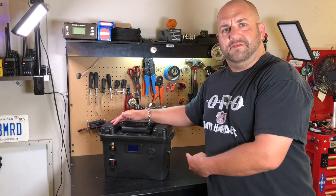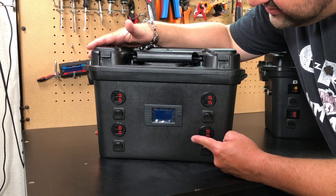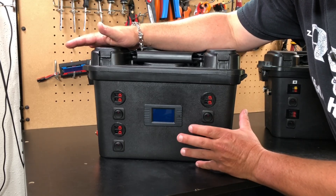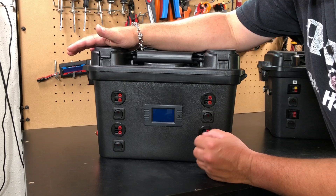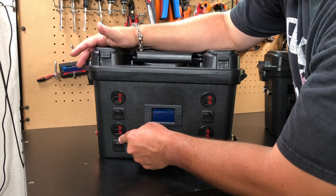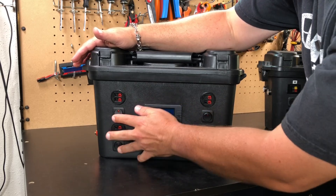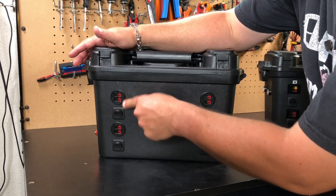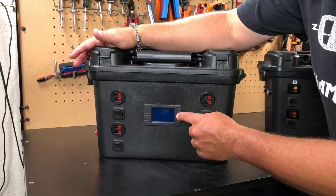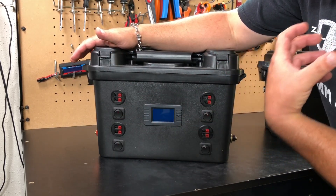This is my battery box — I call it Big Geek. I manufacture and sell these. This is the Big Geek expansion pack. What we have here is something similar to my Big Geek battery box, but there's no battery in here. On the front, we have four individual circuits on 25-amp fuses. Four different radio stations will have their own two-power-pole outlet for powering their radios and accessories. We've got a battery meter here that's going to connect to everything and show the total current draw and consumption.